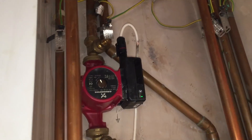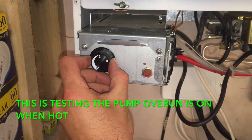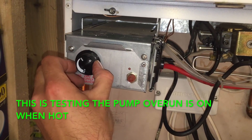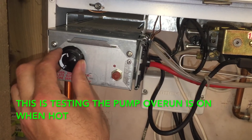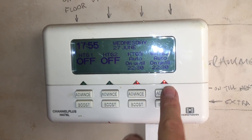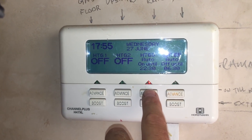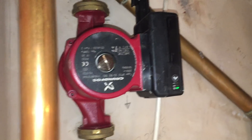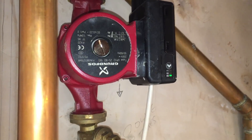Okay, it's all on, let things warm up. The boiler stat is still controlling it all. Originally it was clicking on zero, now that it's warmed up a bit it's clicking further round, so the boiler stat is working — it does turn the boiler off. Let's turn this off now: number one, number two. And now that it's all hot, the pump stays running, demand is gone, boiler stat's still on. Because the boiler is still hot, the pump is running.